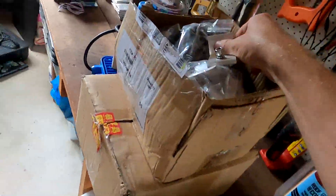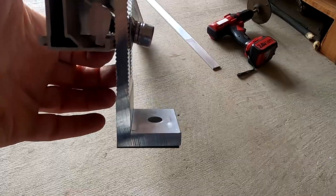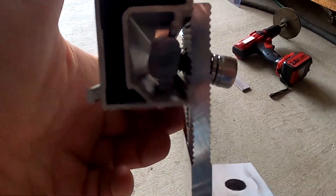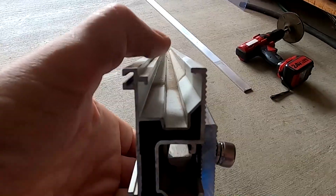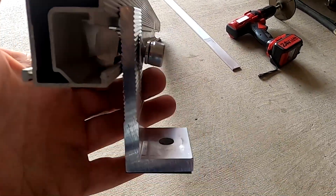Usually, let me explain this. So this is how it usually looks: you've got your L-feet mounting bracket here, which has this weird nut that goes into the profile of the rail system, and then you've got your solar panels on top of them. You can height-adjust this with your bracket.